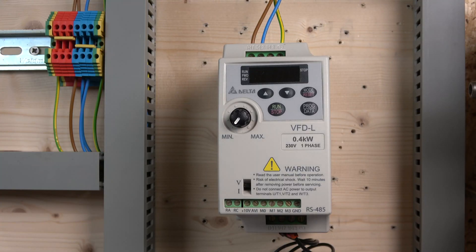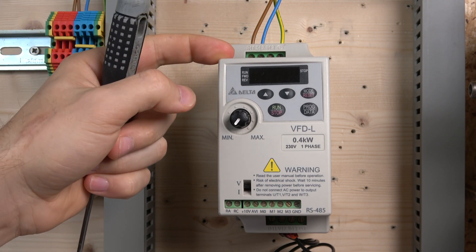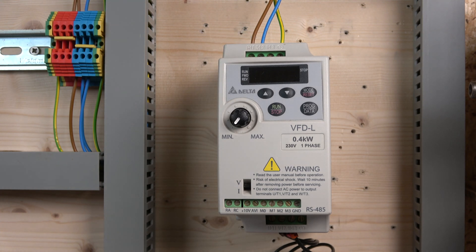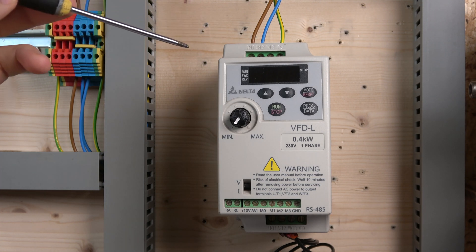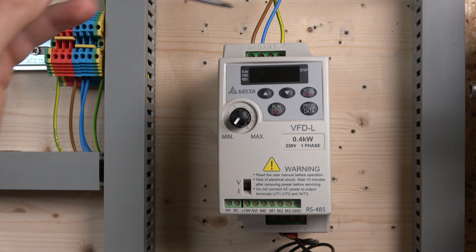Here we are, all wired in — let's go through the wiring as we always do. Power goes in on the top and it actually has three terminals where you can put in the power, as it would be for a normal three-phase unit. Interestingly, they have not blocked off the terminal you're not supposed to use if it is a single-phase drive. In the manual it's quite hard to find — there's no clear diagram for single phase, just a note in text saying which terminals to use. The line goes in R and neutral goes in S, i.e., L1 and L2, and your Earth/ground connection goes in there as well.